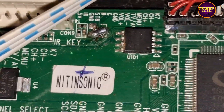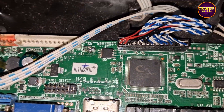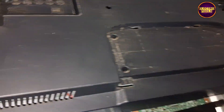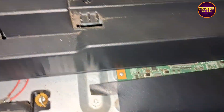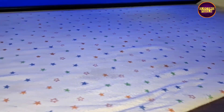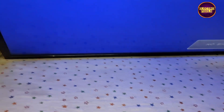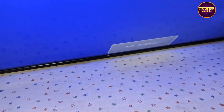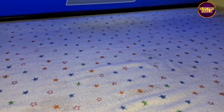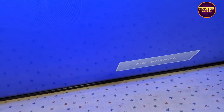Finally, we connected the source and drain pin together by removing the MOSFET. Now the picture comes and the TV is working back to normal, but you can notice that the picture is upside down. We can solve that by entering the service mode. So that's it — finally the TV works well with the new TCON board installed.